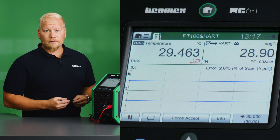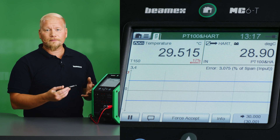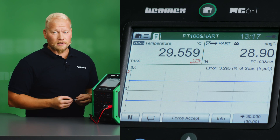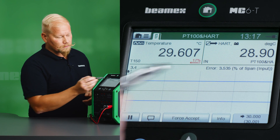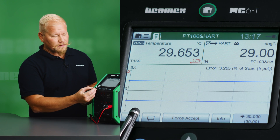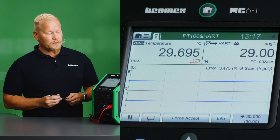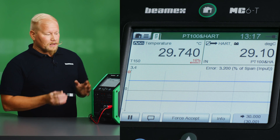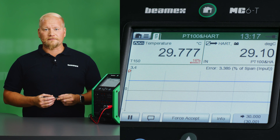The graph part of this view shows my calibration procedure — the set points and how they perform. I have lower and upper error limits shown as blue lines, and I want my point — the moving dot — to be within these two blue lines. If it's below or above the lines it's a failed calibration; as long as it's between the blue lines it's a pass calibration.